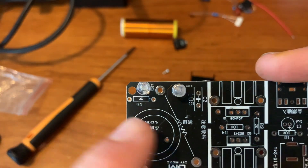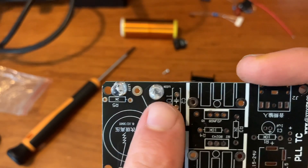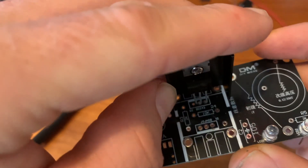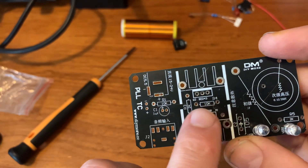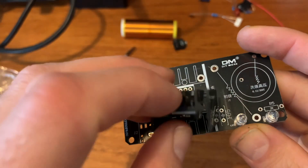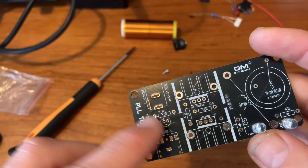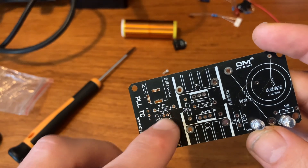So there are two LEDs — LED one and LED two — and we have to install them on here. But let's first do the resistors and also the capacitor, because when we install the big giant ones we don't have space anymore for the other small ones.